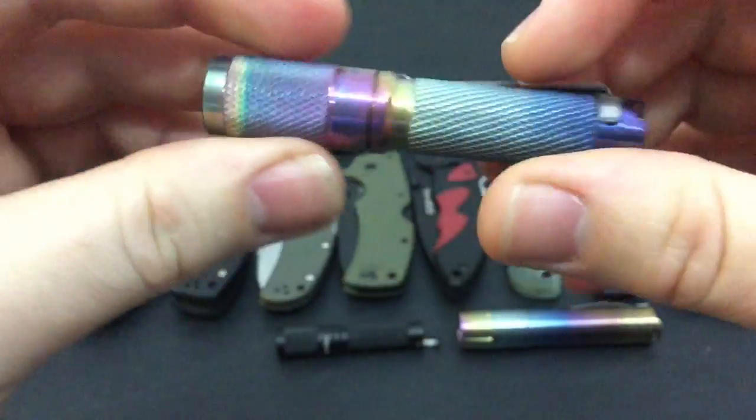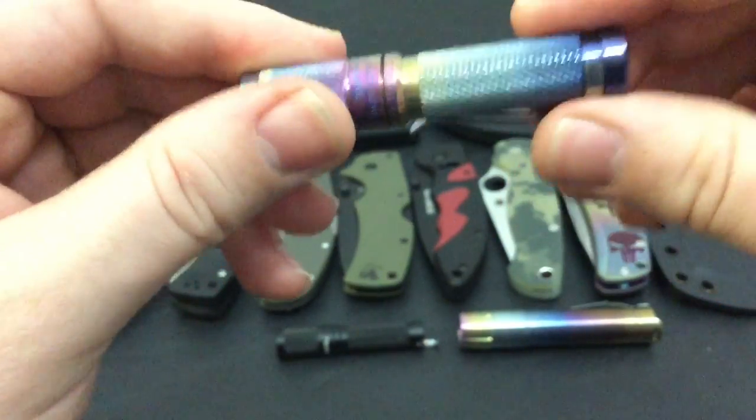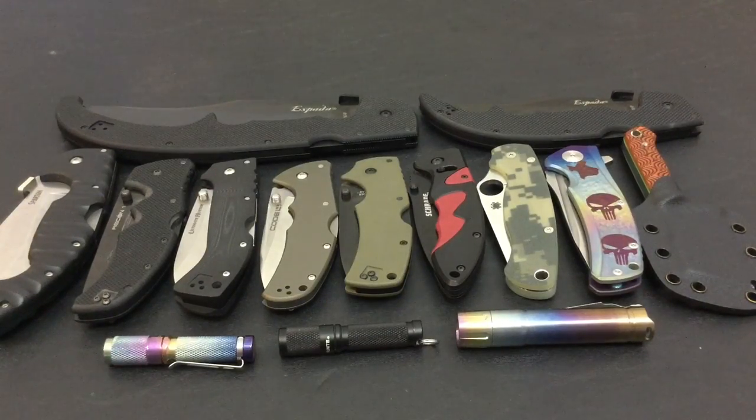If something is waterproof or water resistant, you shouldn't have a problem doing electroanodizing. A lot of people have issues using a torch because that's how they anodize. They don't have the professional equipment to do that. And yes, you're going to fry the circuitry when you take a 600 to 1,000 degree torch to titanium. You will destroy the circuitry, so don't do it.